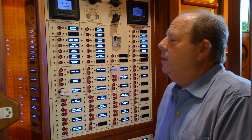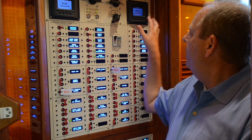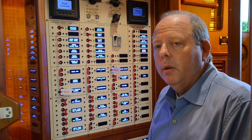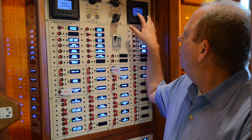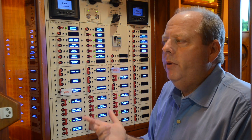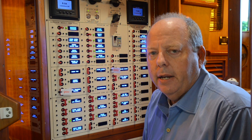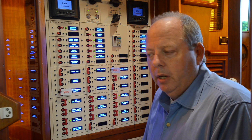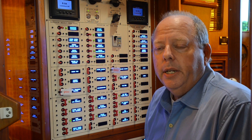After leaving it off for a couple of minutes so the chilled water would look hot to the compressor, my amp meter is now reading 30.4 amps. I watched it go from 0 to 4.4, and then once the pumps and compressors kicked in, I'm up to 30 amps. Now it's going back down — 24, 22, 20, 18. What happened is the compressor kicked on to cool the water, then said the water is actually cool so I don't need to work, and shut back down. That is normal — any air conditioner pays attention to the thermostat, and just because the breaker is on doesn't mean the compressor will run; it will shut off when it sees cold water, just like at home.